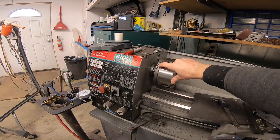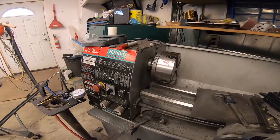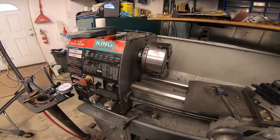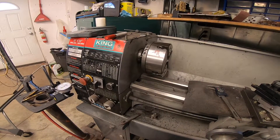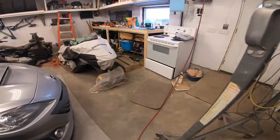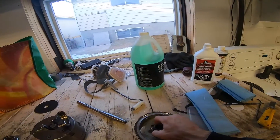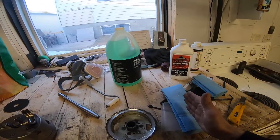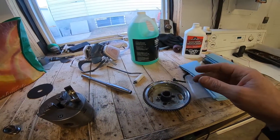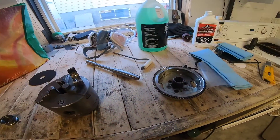From this one spot I removed about an ounce. If you had an ounce of imbalance in a fan or flywheel rotating at 1,600 RPM or in a flywheel at many thousand RPM, that would be completely catastrophic. So if I wanted to use this principle to balance something like a flywheel, what I would want is simply a shaft mounted on a couple of bearings, supported on either springs or hung, with the motor as part of the assembly. Maybe I'll do another video on actually doing that.